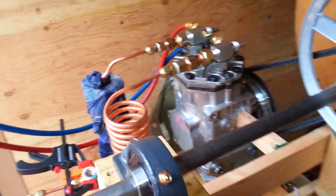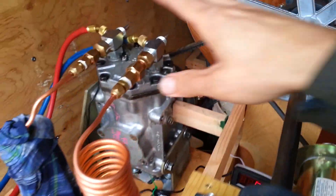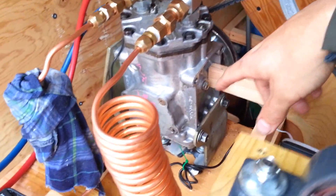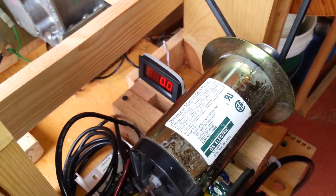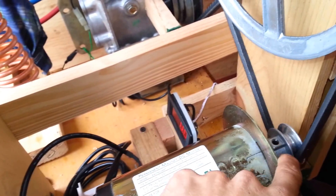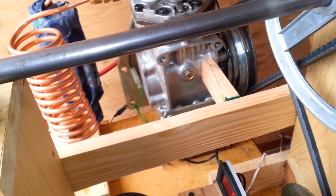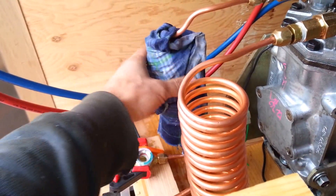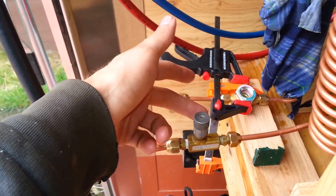Today is the first day I've actually had a successful run with it. Initially when I built this thing, it was just this platform at the base with the compressor mounted. This mounting bracket came out of a 1983 Volvo — I modified it slightly, put some bolts in the bottom with slotted holes so I can adjust belt tension. I had rigged up this treadmill motor which pivots and locks on the end, driving the compressor direct — a 2.5 inch pulley going up to the 6 inch pulley on the compressor. This is the condenser here — my little evaporative-cooled condenser — and this is my throttling valve, my flow control valve.